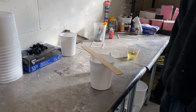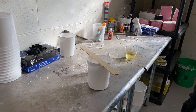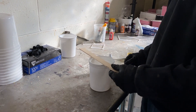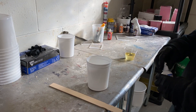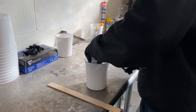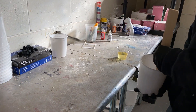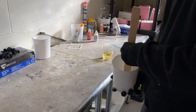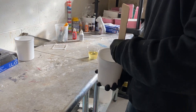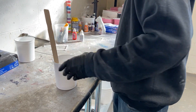Here we have our urethane casting resin. This is our proprietary resin, but a lot of companies make casting resin that you can use — urethanes, epoxies, whatever fits you best. Now, in the bigger white container we have the B-side, and what he's going to do is add just a little bit of white pigment. This is actually a Smooth-On product — a UVO white pigment. The reason he's adding that is when you pour it into the mold, if the resin mixture is translucent, you really can't see it going in. So he adds a little opaque pigment so he can see it in the mold better.